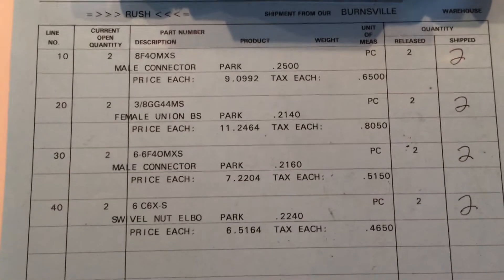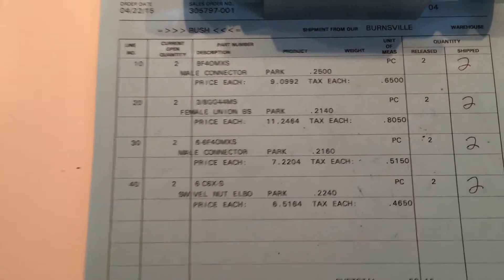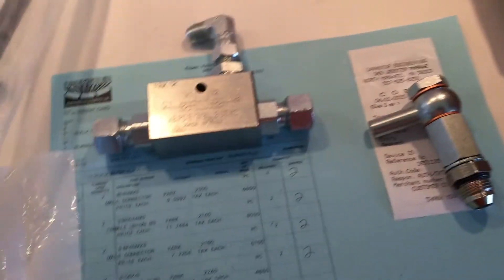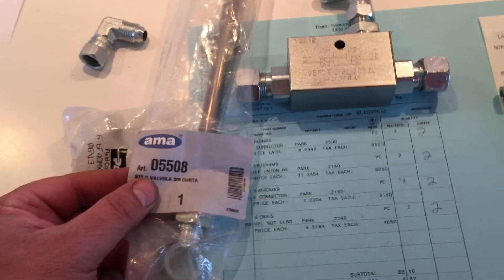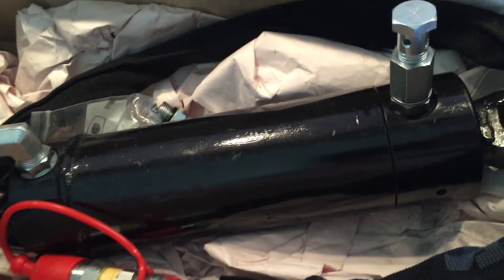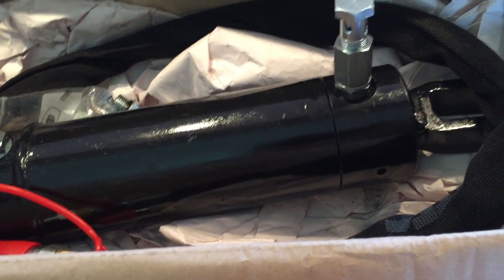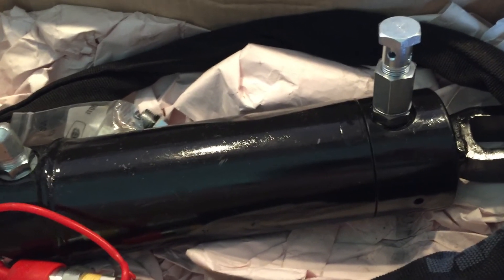I'll figure that out when I get to the field. I went to Parker for the bits — Parker's the most expensive place but here's the parts list with Parker part numbers. This will make the inline check valve work with the AMA kit from Discount Hydraulics — I think it was $58 for the check valve, that's a good deal. Another $73 for the fittings from my local Parker jobber, and the cylinder was around $300 from Michigan Iron. I think it'll be money well spent — I'm super happy to have a check valve so there won't be any cylinder creep if a hose pops. That's all I've got to share. Thanks, bye.